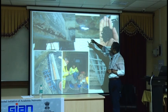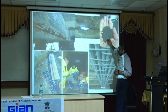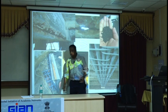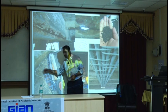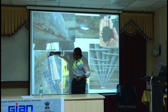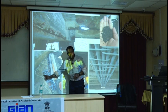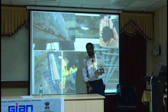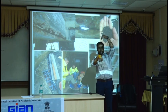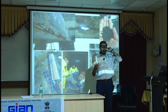You have seen this process — the expansion joint from underneath once the topping was removed, so it was quite damaged. That is the slag from hydro demolition. You can see the hydro demolition job: they take a cutter, cut the top, put a line on it, and hydro demolish that area. One sensor was installed here at this point, one very close to the old concrete, and another further down at the expansion joint. The logic was that water will come in, go down through the expansion joint, spread out — and that is the exact location where we put the sensor to catch moisture.